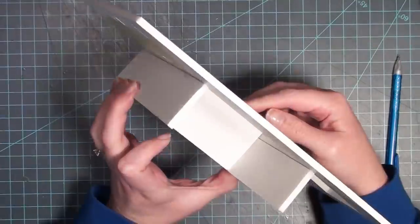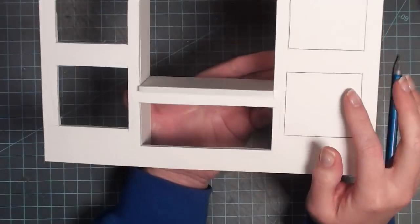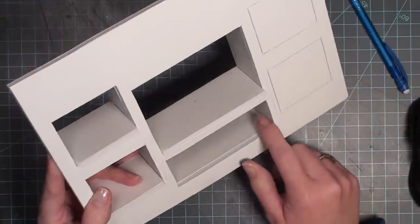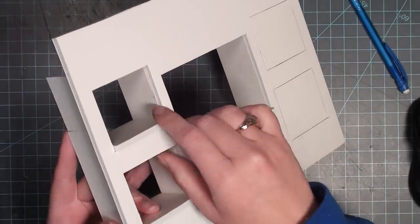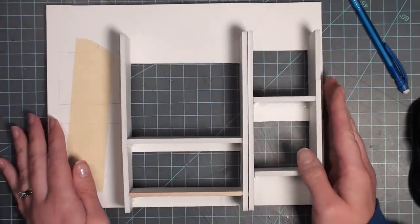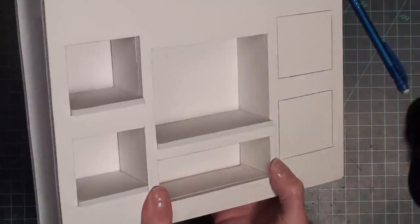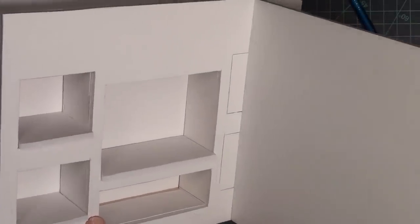I kept the cutouts for each individual space because they become the base for each opening — they're about the same size, so I just put the piece back in, mark off where I need to cut it, and that becomes my base for that particular opening. I'm leaving it open at the top so I'm not framing that part. I'm making sure all my back pieces line up because I do want to put a back on the cabinet itself. I do have to add a little bit at the end, but here you can see all the spaces are framed with a bottom ledge and two side walls, with openings above to hide the lights.